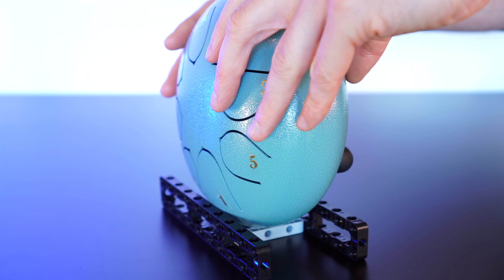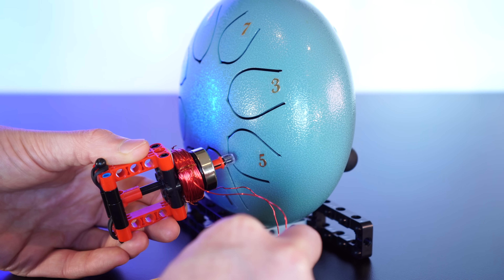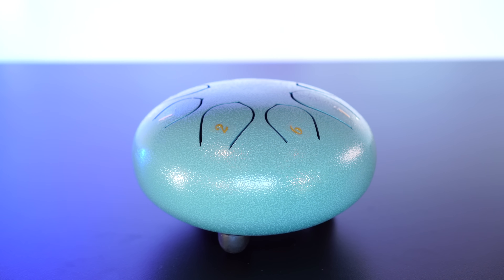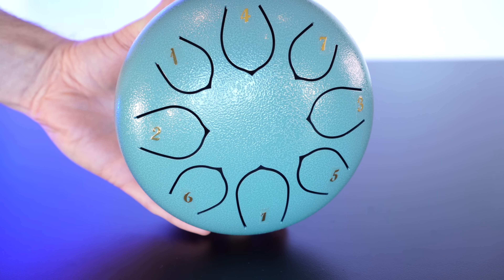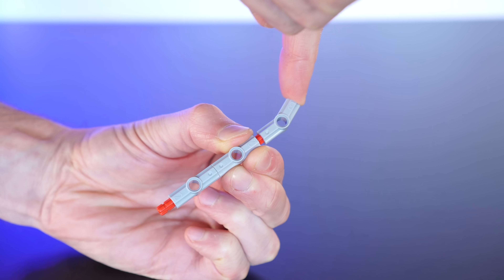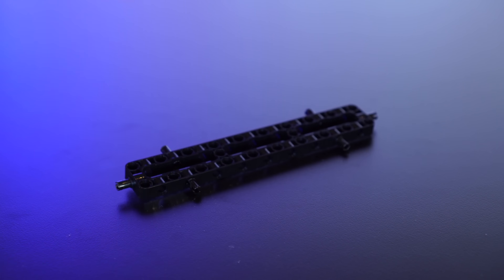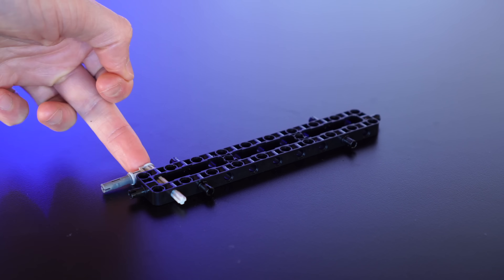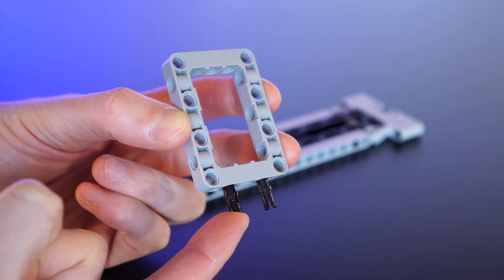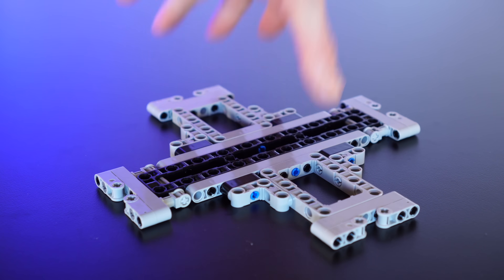So can we get this little Lego solenoid to actually play some music? Well, sort of - it's very quiet. But putting the drum on its side gave me an idea. On its side it still sounds good, and upside down, it also sounds good. So this makes me wonder if there's maybe a much simpler solution to all of this. What if we can suspend the drum upside down, and then tap on it by having solenoid arms fire upwards? Then gravity can simply reset the solenoids, and it makes it much easier to position a bunch of solenoids to hit each note on the drum.